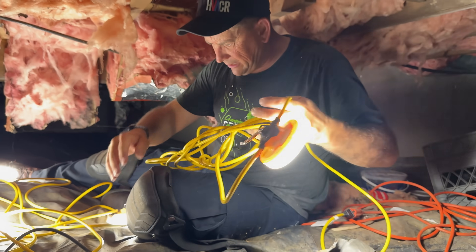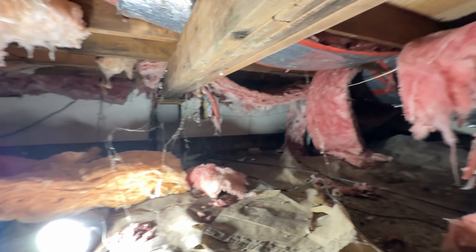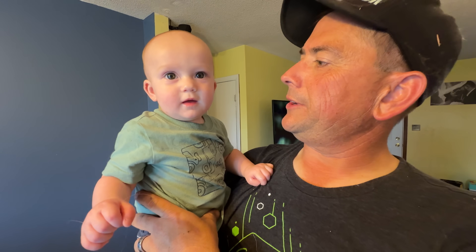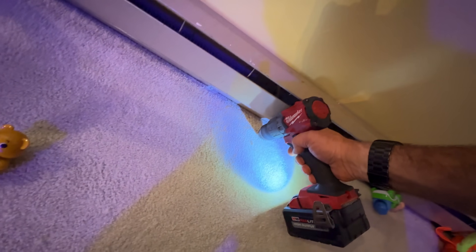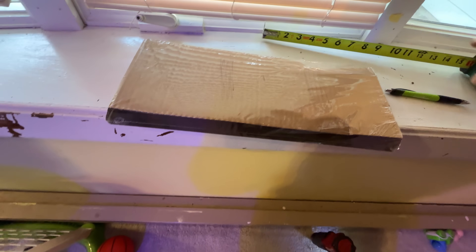We got the light cord all the way down to the end — I think it goes all the way back, so we'd probably be all right. I'm going to put it at the bottom of this joist so it gets both edges. Here's the reason why we're doing this: we're going to get you nice and warm in the wintertime — 15 kW heat and two and a half tons of cooling and heating. We took a clothes hanger straight down through so it leaves no marks. He's going to measure off that to the floor joist. We can put this 14-inch register. We oversized this because the house is very poorly insulated — the insulation has come down. I'm not into drilling a million holes with aluminum siding on the outside, so we're oversizing it.